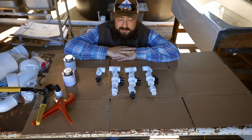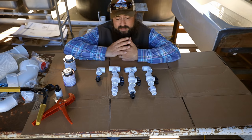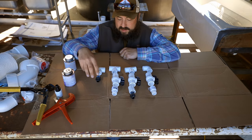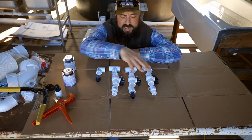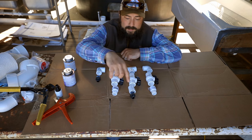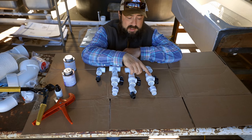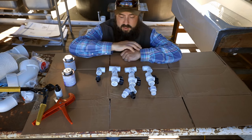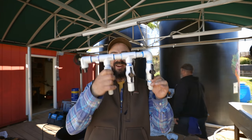Here's the manifold I'm going to build, and this is really in the effort to keep things streamlined, organized, and tidy. I was going to build this out of PEX but it would have cost a lot more money. This is very inflexible once you build it, but I've built quite a few of these manifold setups and it works out pretty well. The water is going to come in with PEX and then convert over to PVC. Each one's going to have a ball valve so you can turn it on and off easily. This one here will go for water for the root wash station; this one will be a PEX line that goes to the float valve filler for the greens bubbler; and this one will be for the sprayer to wash out the greens bubbler. These are all garden hose threads, so we can just screw on a water-safe garden hose and we should be good.